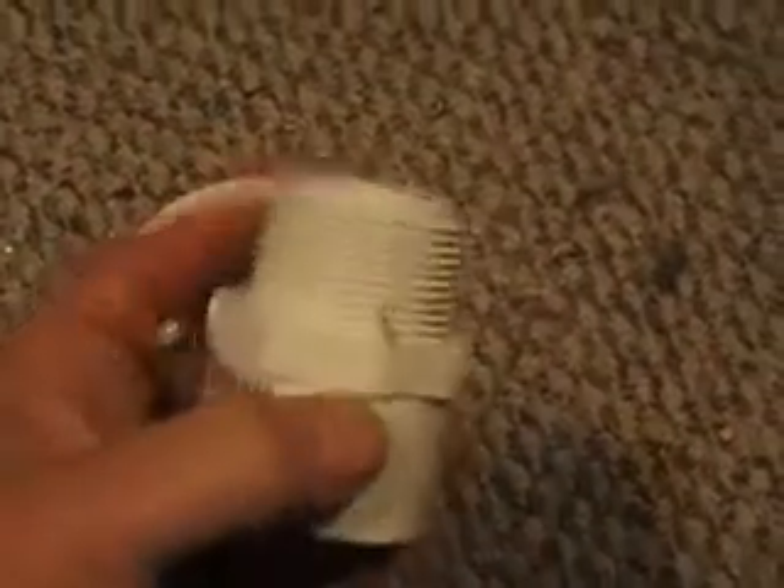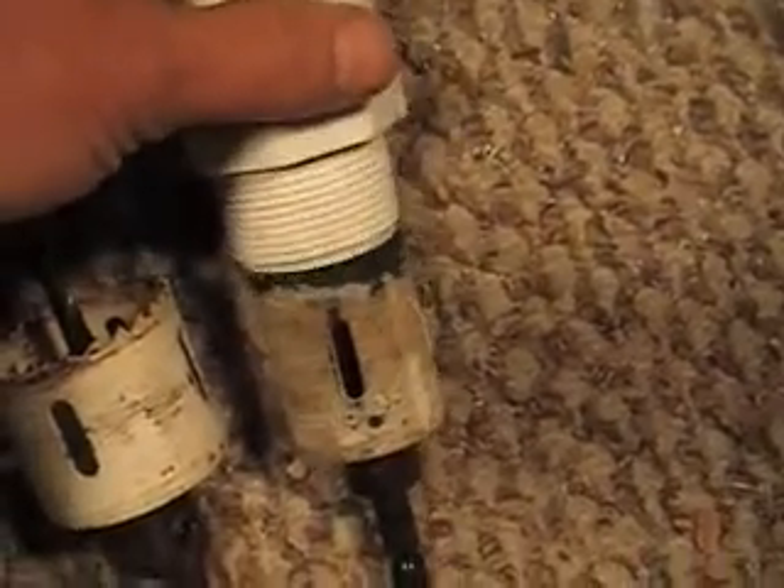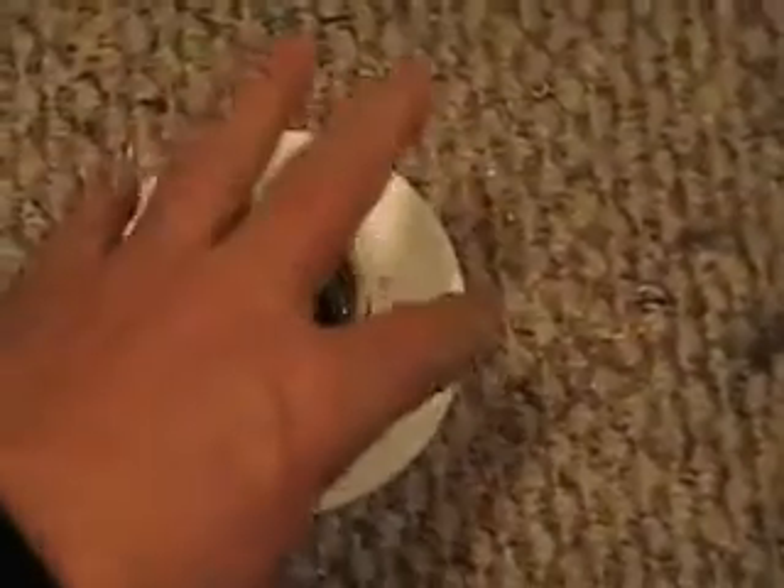This top piece is called a slipping thread - not because you'll slip on it like a banana peel, but you've got a standard coupler end where you slide the pipe in, and on the other side it's threaded. I drilled a hole dead center and screwed this into it. If you've got hole saws like this, they don't make the exact sizes - either it's going to be a smidgen too big or a smidgen too small. I went with the smaller one. I'm going to demonstrate how to heat this up with a propane torch without releasing carcinogens, and how to soften the plastic just right so you can screw this in. Once you screw it in and let it harden - about five or ten seconds - those parts marry up like they were made together in a factory.